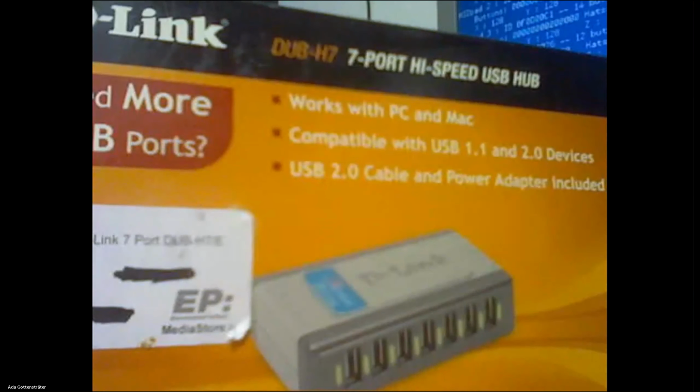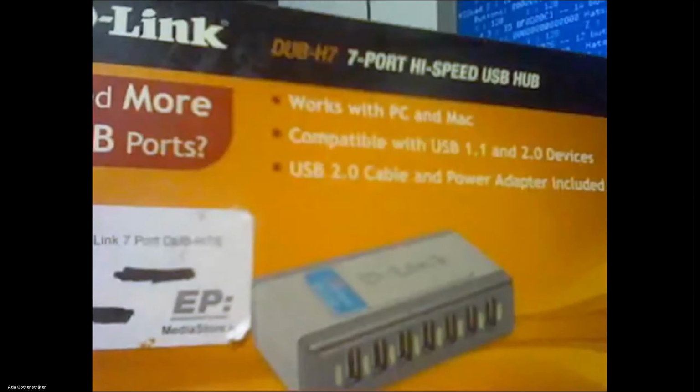And this being full speed USB, can you support a combination of low speed and full speed devices? Yep, it does it all. The main problem is that the way it's set up, the only device it can actually do 7 of is a game controller. Mostly just because of how I set it up and to avoid unnecessary complexity. So you're using it for HID type? Yep, it's just HID devices, but it also does the XInput special protocol magic that you need for Xbox style controllers. Not the actual Xbox controllers you can buy in a store today. They use a different one.